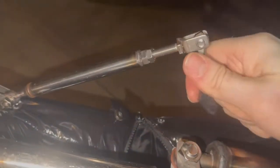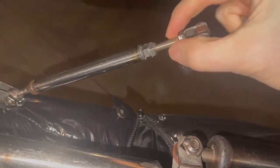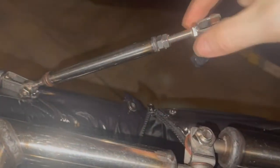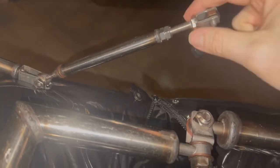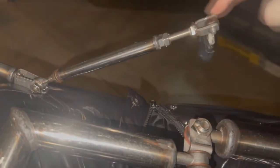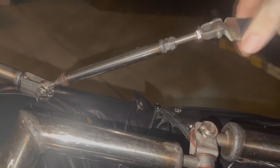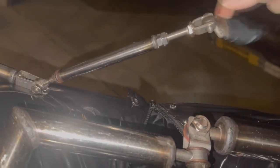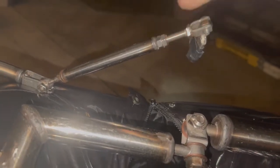This thing does turn, but it's kind of hard to turn. I wanted to make a turn here and have this section be pretty much rigid except right here. I wanted the turn to be somewhere in the wrist area to pronate and supinate the wrist. What I did is I cut off right here all the way through, removed all of this, kept just this little stubbed-out piece, and then ground down the teeth on it.